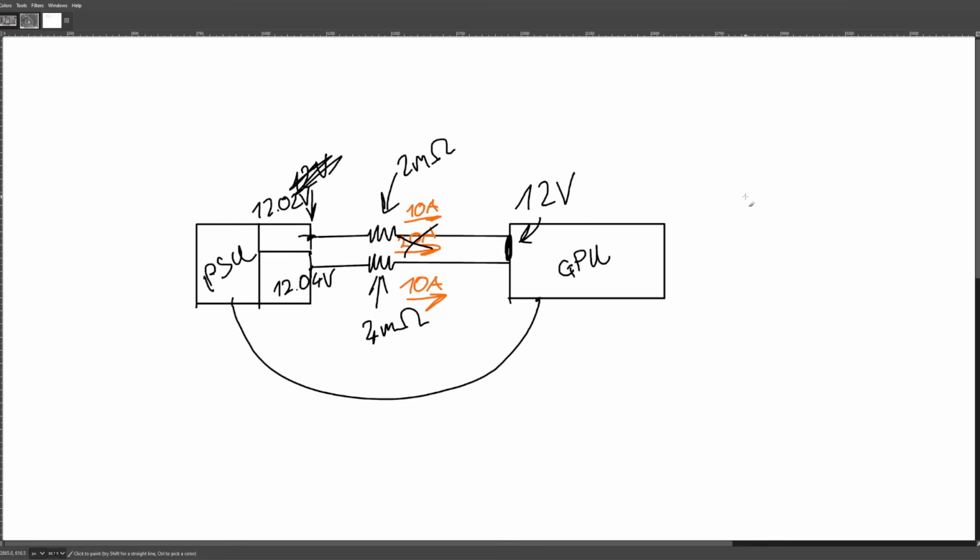Also, we got rid of all of the current balancing. And not just the optional stuff, all of it. So you better hope that you plug in that connector just right, because if you don't, it might melt. And if you're lucky, you'll only find out when you go to unplug it when you're upgrading your GPU. Which I guess is going to ruin the resale value of your card on the second-hand market because somebody's going to have to dig the plastic out of that connector. Huh.